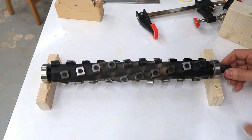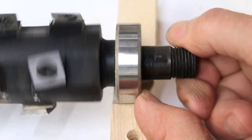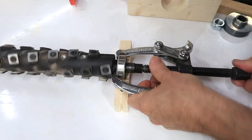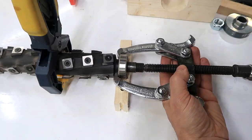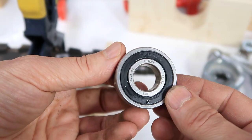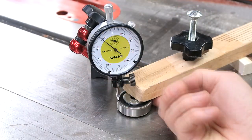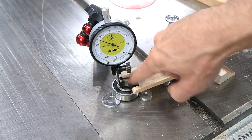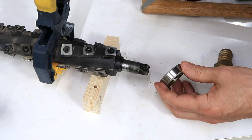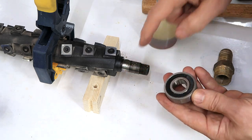With just the bearings, I can't particularly see them wiggle - though I can see this one wiggle a bit, and I can certainly feel it wiggle. It's a bearing from Turkey. I suspect these might not be quite as good as the German or Swedish bearings. But checking the bearing itself, I can't tell that it has any misalignment - just a little bit of slack. The problem is I don't have a press for putting this back on, so I'll have to improvise.